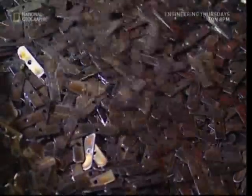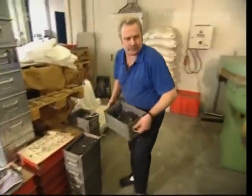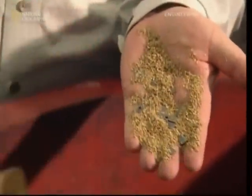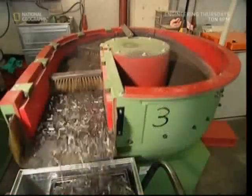But yet again the blades are coated with oil, so another bath is necessary. However, this time they're not washed — instead, the blades are immersed in sand which absorbs the oil. This is a rather messy process and the workers end up with a giant drum full of oil, sand and blades. To clean this off, they're passed through sets of brush heads and over big sieves, leaving clean hard steel.